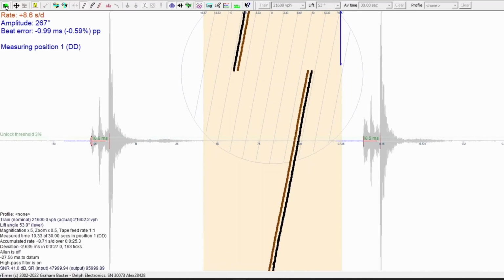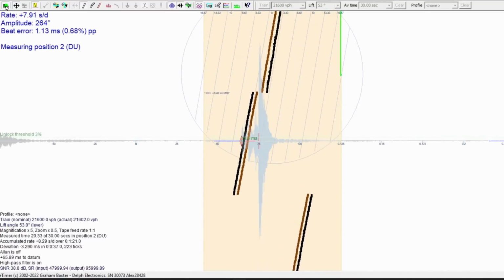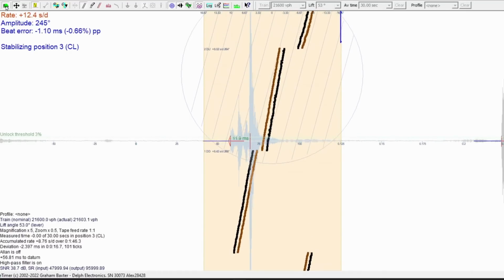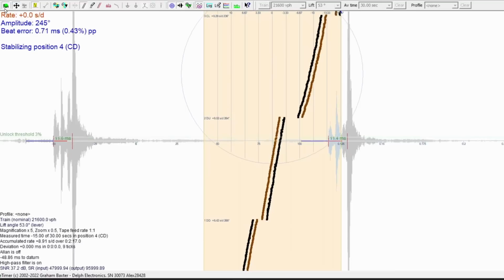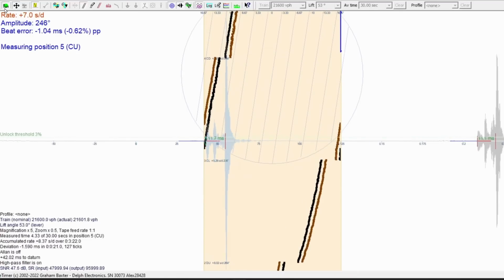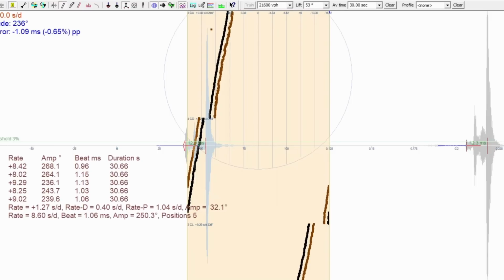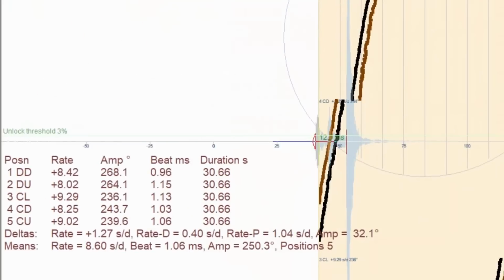One thing that I'm sure many people don't realize is that production movements like this are almost entirely assembled and lubricated by machine. That means that the precision of application, as well as the amount of oil deposited into the jewels, is very inconsistent and it'll vary from one movement to the other. For what these movements are sold for on a wholesale level, there really is very little room for human interaction in the production process. That means that the regulator, as well as the regulator pins, are machine set as well. And this is the primary reason there is so much variation in the values you see on timing machines from one movement to the next.